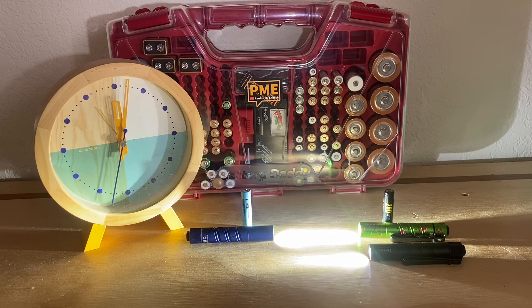Those are the only ones I have tested, but I really like them on the original i3Ts because they might not be the absolute brightest, but the amount of light you get for the duration — in my testing it's almost double the amount of time. If you're interested in that video on the SoShine batteries in the i3T, that will also be in the description below. One other benefit of lithium iron phosphate battery chemistry is that the lifecycle — the number of full charge and discharge cycles you can get out of a single battery — is a lot greater than with lithium ion.